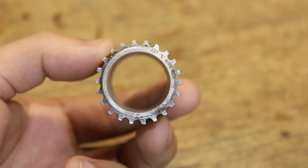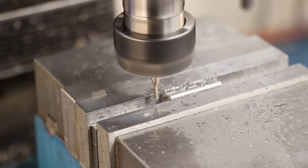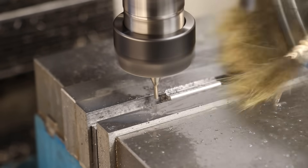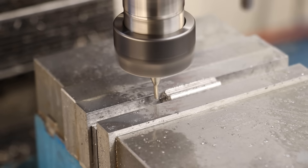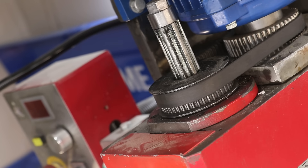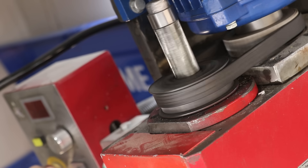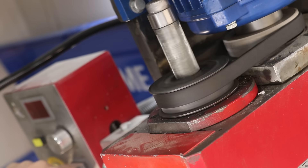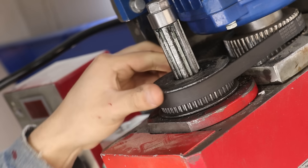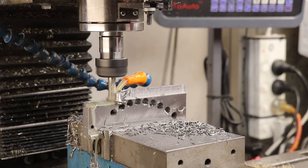The reason for that is that at its core, the teeth are simply a 1.5mm radius arc with about 0.5mm extra depth to form straight sides. On face value, this is simply a job for a ball radius end mill, and it probably would be that way if the milling machine could go about 2-3 times as fast as it currently can. The problem is, when I picked the motor a few years ago, I got a model that did about 1000rpm to maximise the torque at the spindle speeds I usually need — anywhere from about 600-1200rpm, which is pretty normal for regular sized cutters in steel.